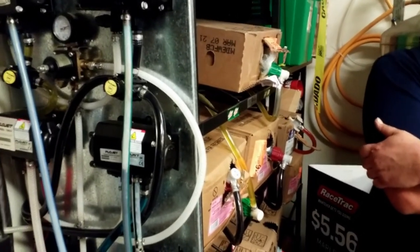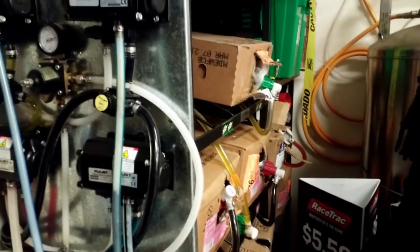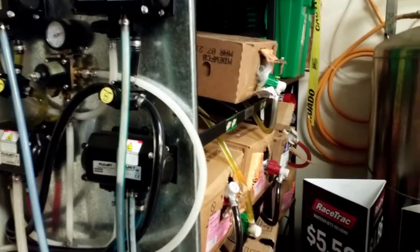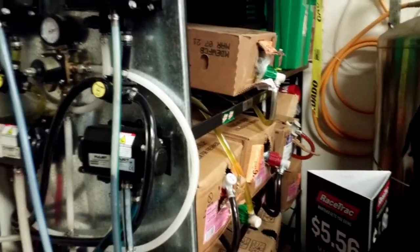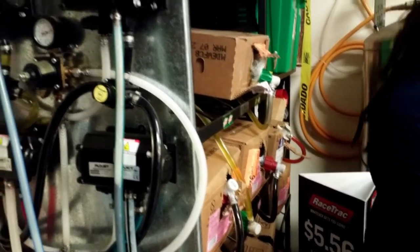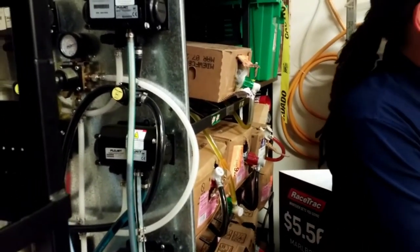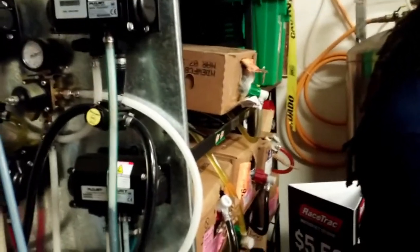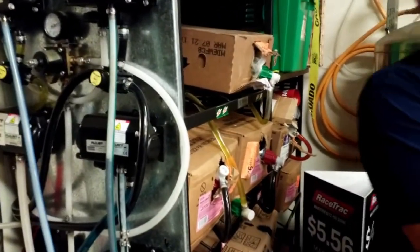So here is a piece of tubing that has split open, and you can see the little tiny film that's that barrier tube. This thing's ready to burst. I've seen it stick out like a bubble. Yep. Okay, so that little film is in there, and that thing is eventually going to bulge out, and when that thing lets go, you're going to empty that bib all over the wall. So if you ever see that, fix it.